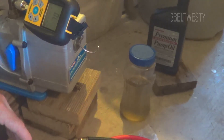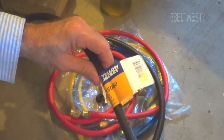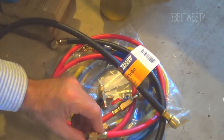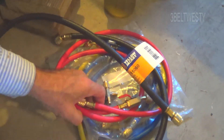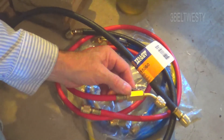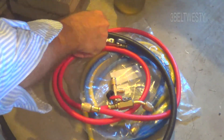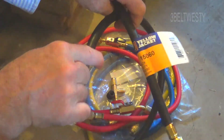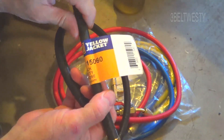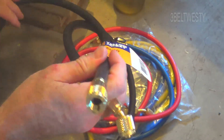You may also want to use quality hoses. Here's a Yellow Jacket gauge — it's a low-permeability hose. If you use regular hoses, like this cheap Chinese set that's only about $40 off eBay for three with a valve, you're going to get some leakage through the rubber. This is a high-quality hose — just this single black hose costs as much as the entire cheap set. It's designed for vacuum, so it has less loss through it.